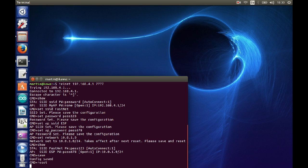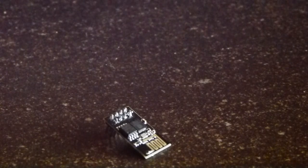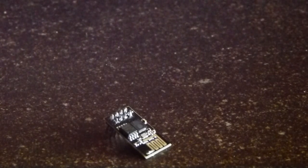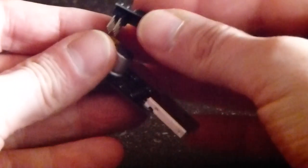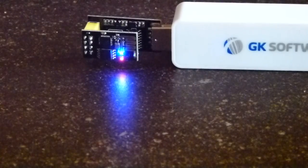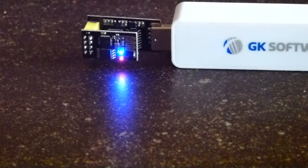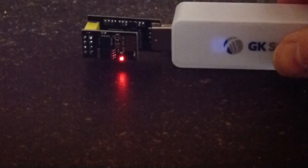I've built several prototypes. You've seen the one on the ESP12, but of course it also works on an ESP1, as it doesn't need much more than a serial connection for flashing and debugging, and one LED as a status LED. Here we use an ESP1 module with the built-in blue status LED. We connect it to a power bank — this works for several hours. The LED is blue, and as soon as it starts blinking, it has the uplink. Now it's connected to the uplink AP and it's ready for station connections.